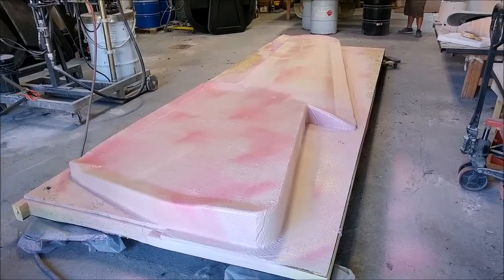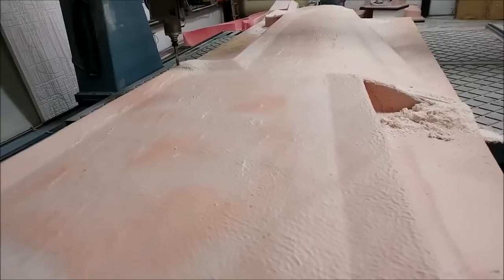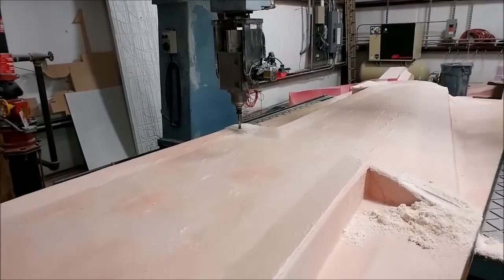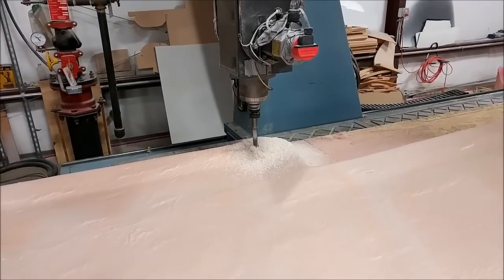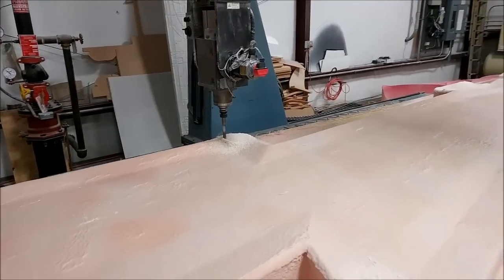Here it is just getting its coat of putty on there. It wasn't long — around about lunchtime we had it up on the machine and milling it, not wasting any time. You can see just starting out with the ball mill on these corners of the flanges, which are sort of rounded so you need to do those with the ball mill first, because the flat mill passes were going to take a while.